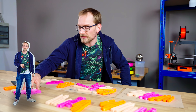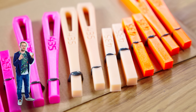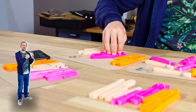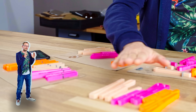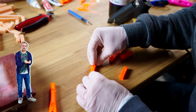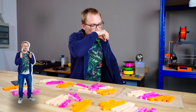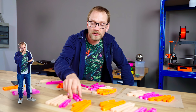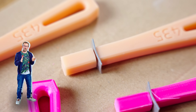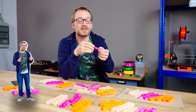What really worked well are the two-part epoxies or MMA adhesives — the Weldix and the JB Weld. Both of these looked really nice, were super easy to work with, had just the right consistency to get good squeeze-out, and nicely filled the gaps. The JB Weld still feels like it's got a bit of tack to it, while the Weldix is a lot harder, but both are sufficiently cured. The hot glue and the Fix-All were also super easy to work with, and both filled up the gaps very nicely on both the zero-clearance and 1mm clearance joints. The VHB tape was interesting — it looked great while working, but it appears to have pulled back from the curved joints, leaving only a small contact patch at the center, while the flat ones are fully covered.